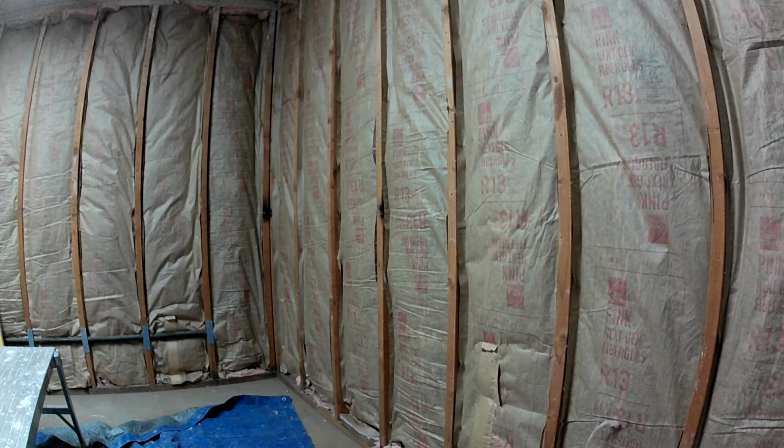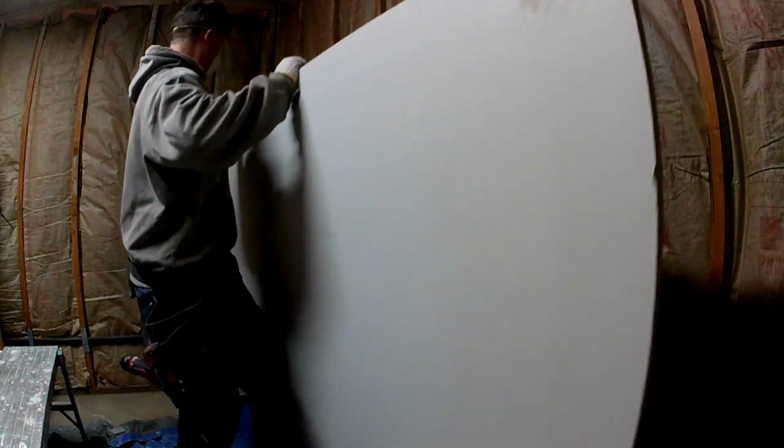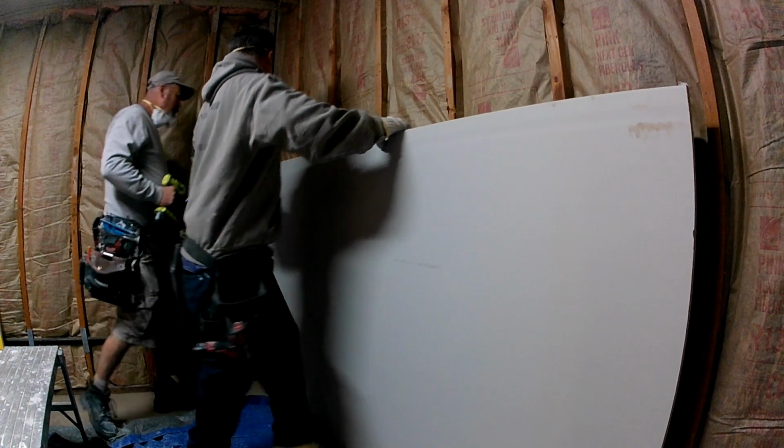Also, you're going to notice on this sheetrock, I just stacked two sheets on one wall and created a railroad butt. It's no big deal. It's just a closet. I didn't want to cut down a sheet and stagger it like they call brick pattern. So no big deal. It's all going to get mudded anyways, and it's just a storage room.